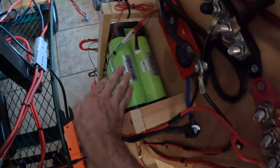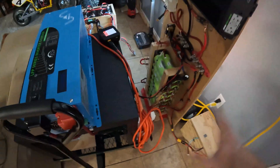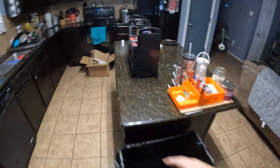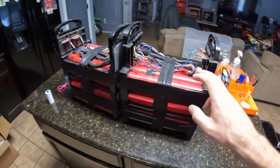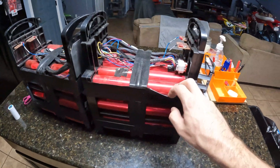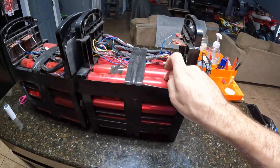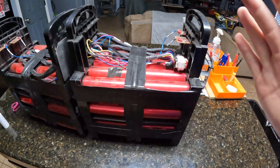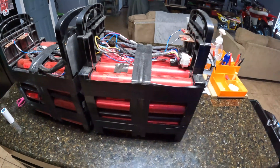These are lithium iron phosphates. The cool thing about all these cells is they're all different configurations. These could also be used for solar. Because of how much discharge rating these have — 200 amps per cell — if you put two of these in parallel, you could potentially pull 400 amps. I don't know the exact specs but 200 amps is written everywhere on the internet.